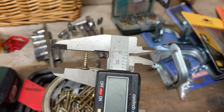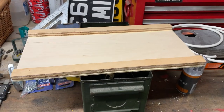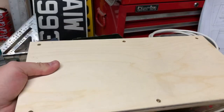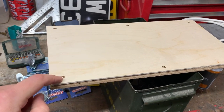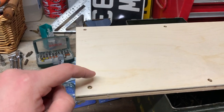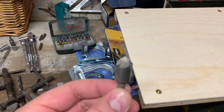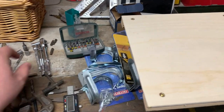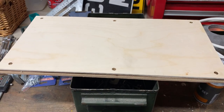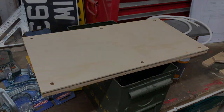So let's see if we can pick out a couple of them, get them glued on it, and then get some screws in. So, making some progress on the tailgate. The upper and lower reinforcement bits are on. I didn't think I'd be able to countersink these, but turns out you can. I suppose 4mm is probably still enough, because the countersink bit, which is here, is not a particularly steep angle. So, countersinking, clamp, glue on, and then screw the screws in, and the little short screws seem to be doing their job. So I think we're winning.